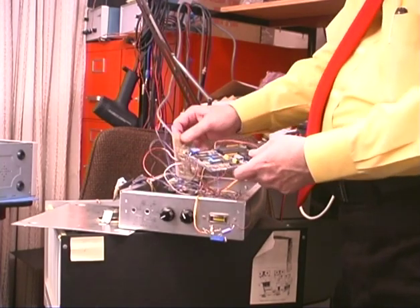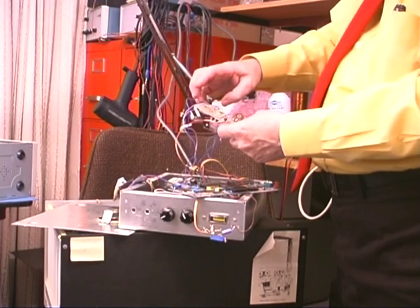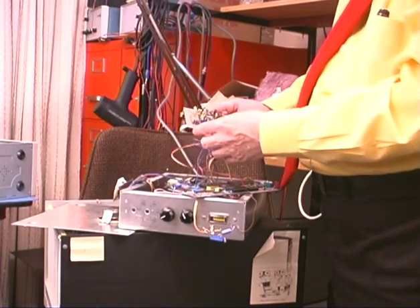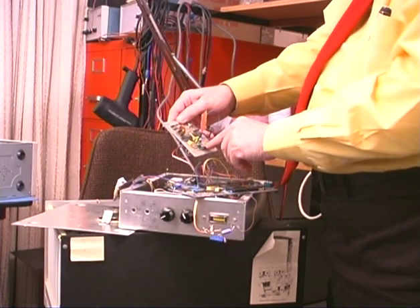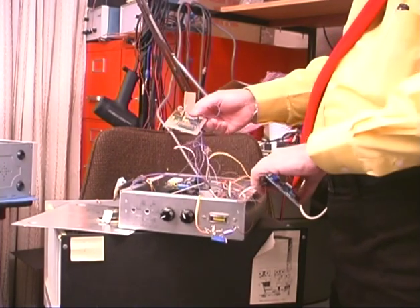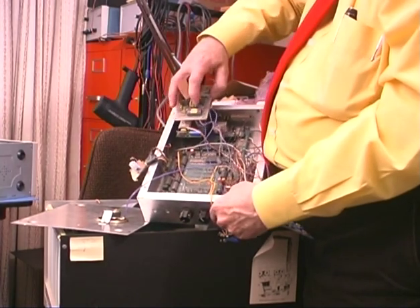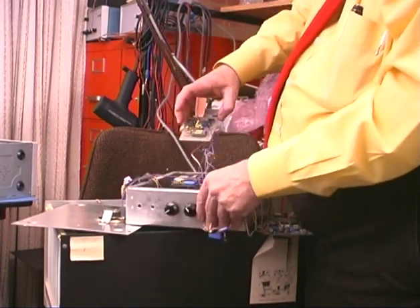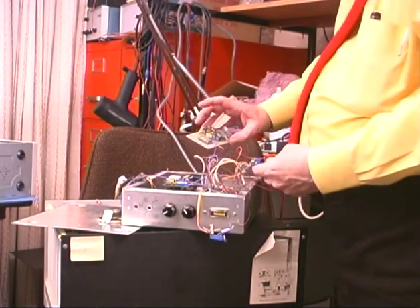And then eventually, sometime in history, there's no date on it, but I guess it's probably around the early to mid-80s, I added onto it this Motorola one-chip modem, the 145445, which was the first one-chip modem, and basically that one chip on this board, the ceramic chip, does the job of pretty well everything on the green board from 3 or 4 years before.